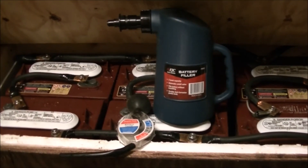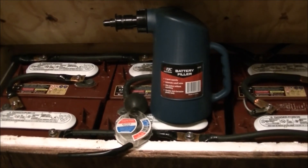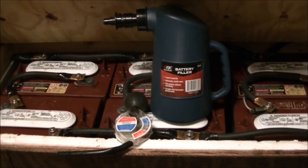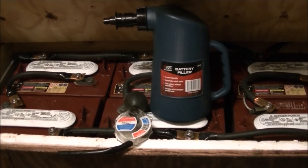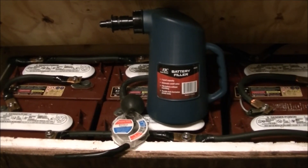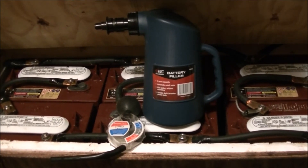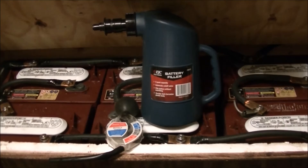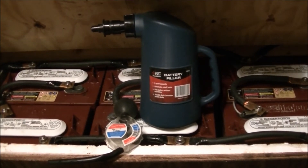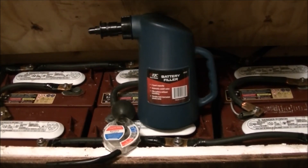What I do for my battery maintenance is once a month at night, I come out here and I'll pull the caps off and check the water level. After I know the batteries are fully charged, I'll check the water level. If the water level is low, I'll just add water. That water filler is a really cool product — it's like $5 or $6 in America. You just shove it in the cell and it fills the cell up pretty evenly. Then you just move to each cell, which keeps them all even and full.